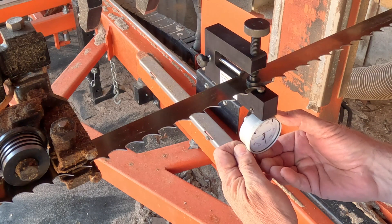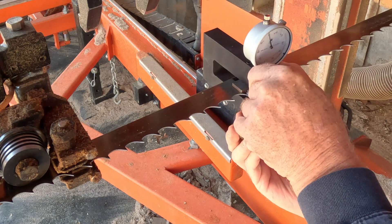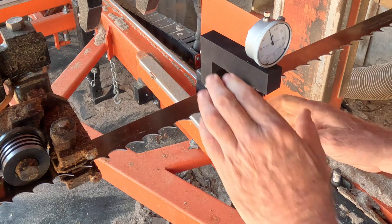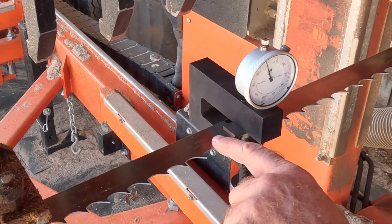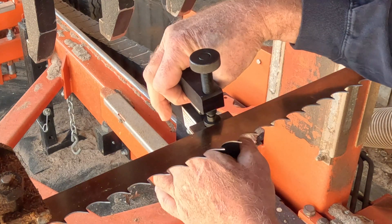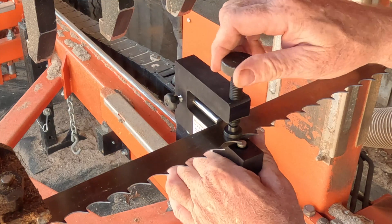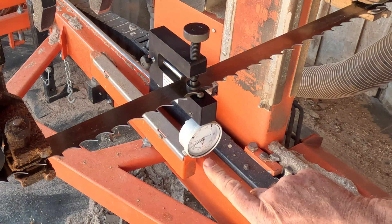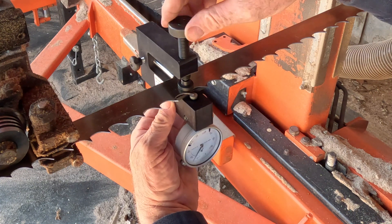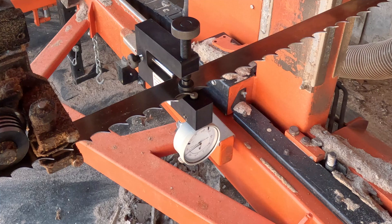You'll notice there's just about a thousandths of an inch difference — I'm going to split the middle. It does take a second to get this thing right, but when it's right, it's right. Now what we want to do is find a down tooth. There's a down tooth right here. You notice how I'm setting the little dial indicator right in the center. We're right at 25 thousandths. Let's check another down tooth — and again, we are right at 25 thousandths.